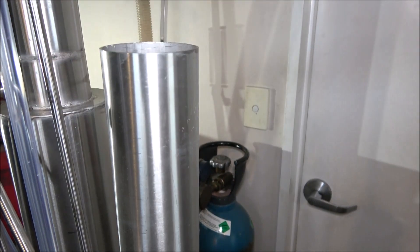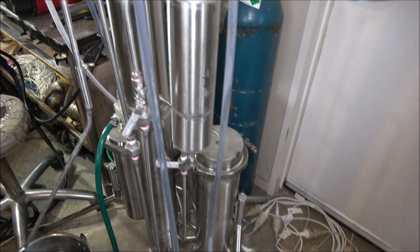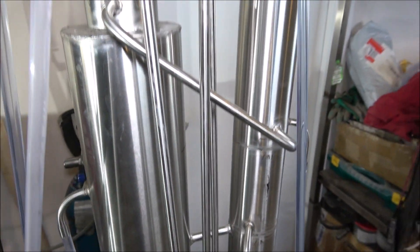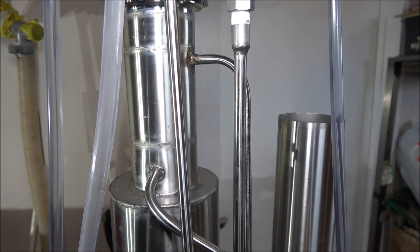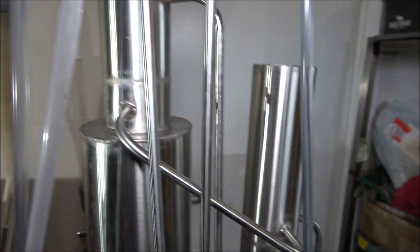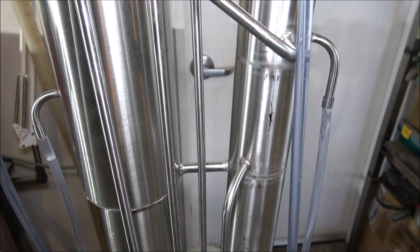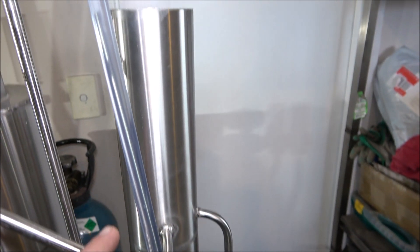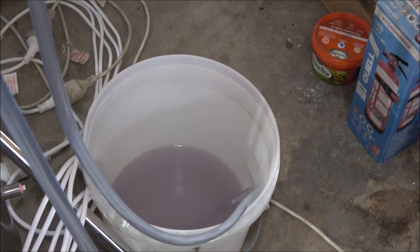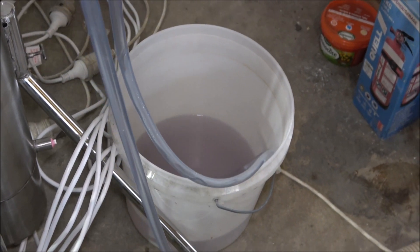This particular side column is for water and wastewater separation. The first, bigger column is the stripping column — it makes about 40 to 50 percent alcohol and evaporates it further with reflux. This particular portion actually collects the water that's been cut from the alcohol, and it all goes over here into the separator. We can collect it separately — it may still contain some alcohol that we can process later, so we're not throwing anything away.